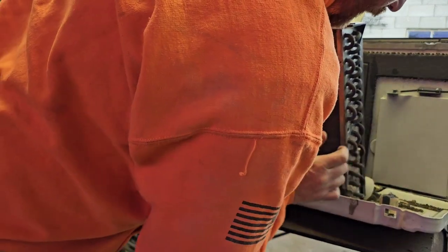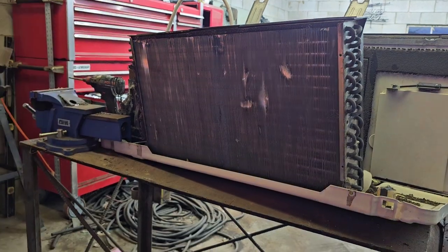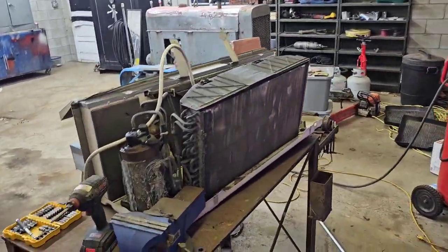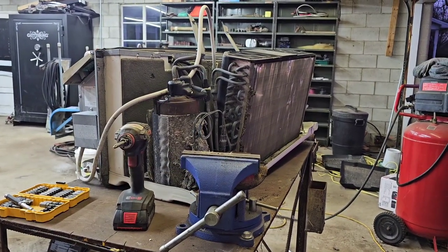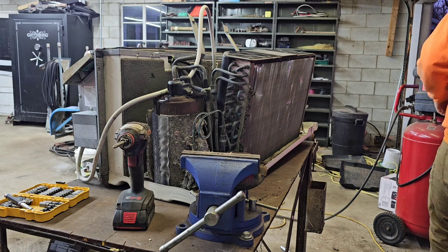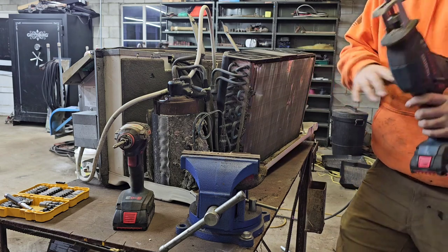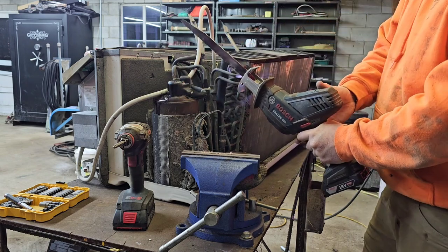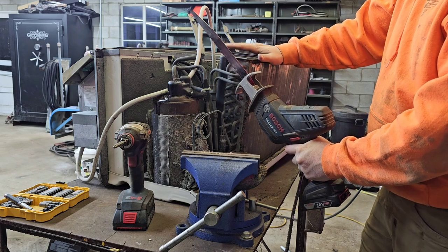There's another one down there I'm not gonna be able to get to without taking this out. So I'm gonna grab my sawzall - we're gonna cut these copper lines over here. Moving the camera so you can see what we're doing. Got some copper lines there connected to that compressor - we're gonna cut them and pull this coil off and set it to the side. There's no freon in this - I was told there's no freon so we don't gotta worry about that.